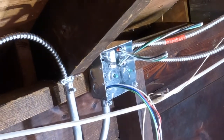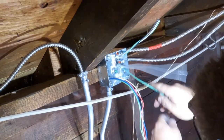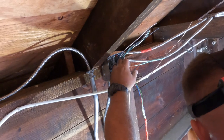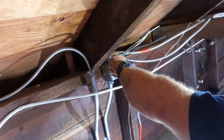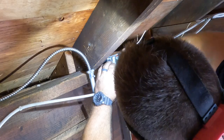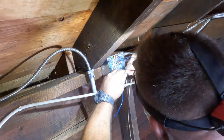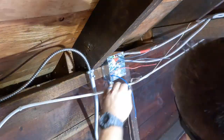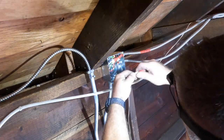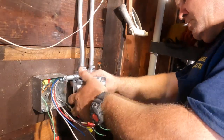Here's my junction box for the two ceiling lights and two receptacles. I snaked up four THHN conductors — red for the lights, blue for the receptacles — plus an equipment grounding conductor and a shared neutral for both loads. Up top on the ladder you can see the garage floodlight wiring from earlier: I stripped back the MC cable and pushed it down the conduit. I used a form-two connector on top of the conduit on the left, which tightens the connector to the conduit and clamps the MC cable — that's a code requirement.